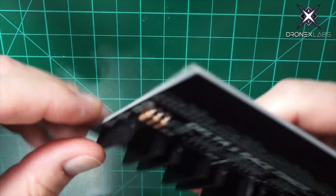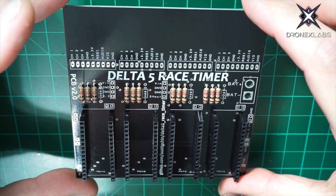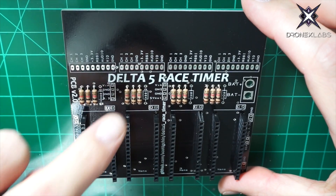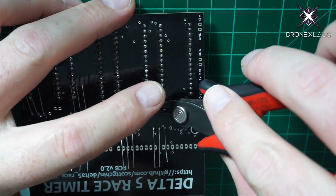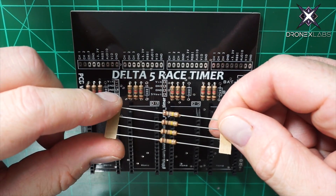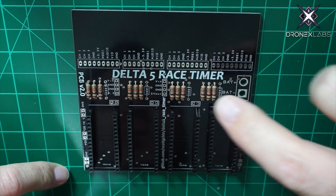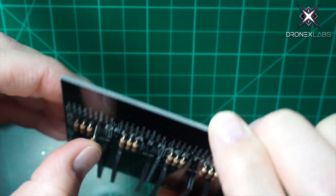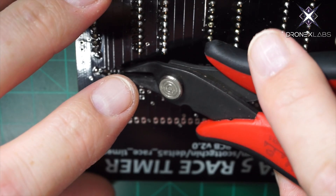Check that everything is lined up and the holes are completely filled, then continue with the rest of them. You can see they're all complete — done for each one of the four Arduino sets: first, second, third, and fourth — and they all line up to their respective Arduinos. I clip the excess with some little side clippers. Now for the 100k resistors, they go in these four locations. Same process: fold down the legs, push them through, tack them down, and clip the excess with side cutters.